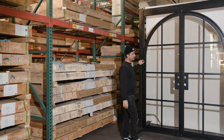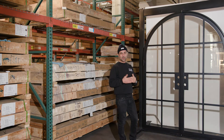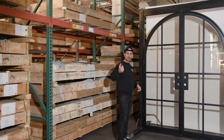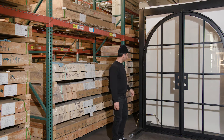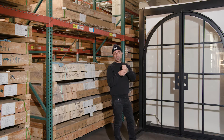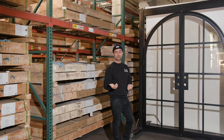These are all greasable hinges — they have a little grease nipple on top. You can put a grease gun on it and grease up your hinges so you don't have issues over time if the doors ever need lubricating. When doors don't open for a long time, grease tends to dry up. Just put a grease gun on top, pump it once, and you'll get enough grease in it. They'll last you another five to ten years depending on usage. They also have a little copper crush washer inside that takes the friction away from the two metal hinges — the male and female hinges sitting in between. Copper crush washers are universal; you can purchase those from any hardware store or call us and we'll send you some.